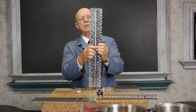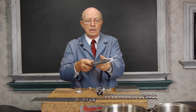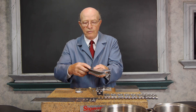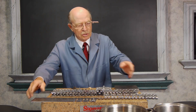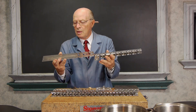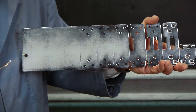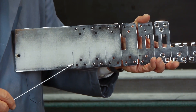And this is a hinge. If you can envision big conveyor belts like in a coal mine — this comes apart and you put it together, and they put a pin in here, then they put rivets inside. How is a hinge like this made? Here's the sheet that comes out of it, and here's the way it was done. Here's a big coil of steel and it's fed into the power press. First of all, the power press comes down and stamps these six holes in here and puts this little notch in over here.